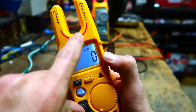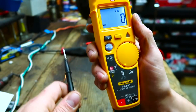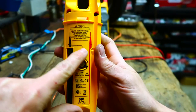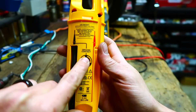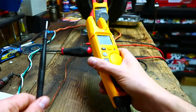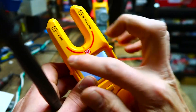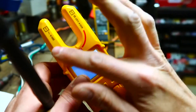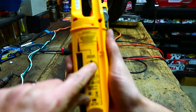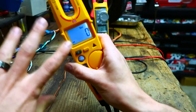The field sense technology works like this: you put your wire in here much like you would with an amp probe, but you need to ground the black lead — you can touch it to a known ground, or option B is put it in the meter. There's some sort of coupling between the tip of the probe and this contact pad, and you're supposed to touch the pad. The best way is to touch this to a ground, put the wire in there right on that little tip, then touch the pad with your hand and touch a ground with the other hand. It gives you a reading within plus or minus three percent accuracy.